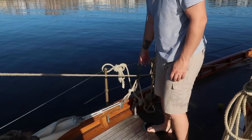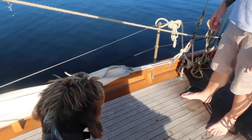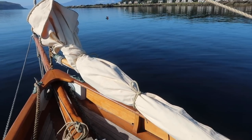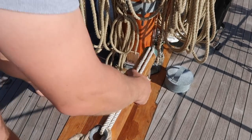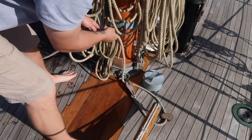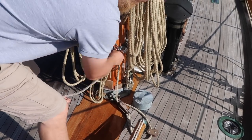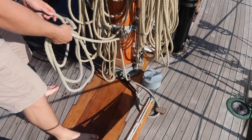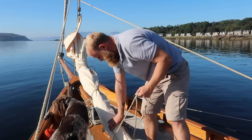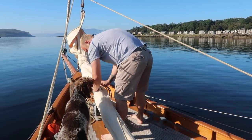I'll show you the staysail — it's quite simple, it's on its own boom currently put away here. I'll move that to the center of the mast so it'll swing from there; it's got a sheet you can control just like any main boom. We'll send it out, hoist it up, and then put it away just so you can see it. I've coupled the sheet down to the base of the mast, leave it about here so it'll sit down, tie it off, and then as we hoist the staysail the boom will come up and you can set it for close-hauled and so on.